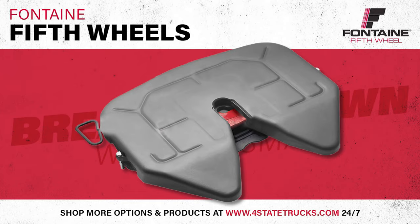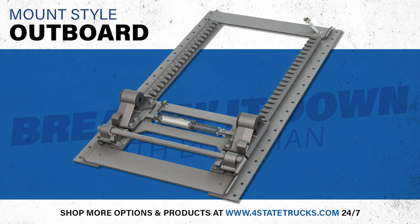When it comes to fifth wheels, the 350 Chevy equivalent is the Holland product line - it seems like every truck since the 60s, 70s, 80s, the far majority had a Holland. A good percentage also had a Fontaine. Today, as of the last decade or so, Jost - J-O-S-T - fifth wheels are coming on relatively strong. We're going to show you how to identify if they're inboard or outboard, standard profile or low profile, and how to measure your slide bracket.